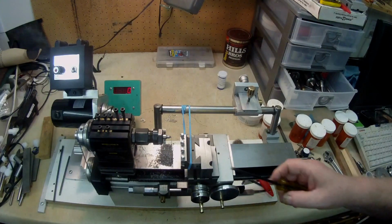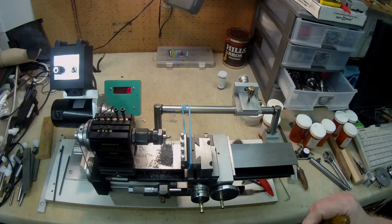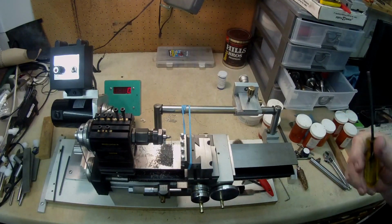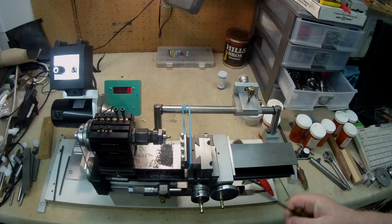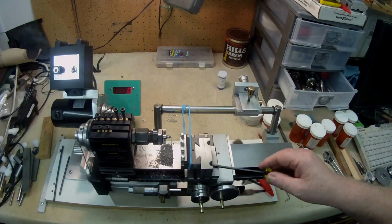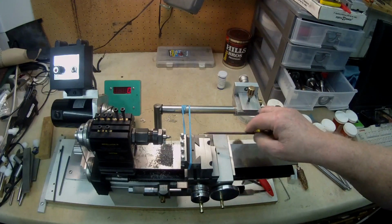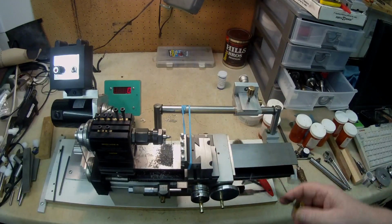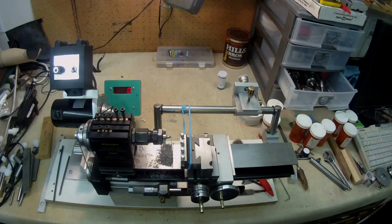A couple of mistakes I made on this, and I put it down to working things out in my mind instead of double checking with drawings. I would have noticed it, I'm pretty sure, if I'd done a drawing. When I put the two step pins underneath this base that aligns the tool in the T-slots, it means that I don't have to square anything up. That automatically squares things up, and then I just nip the T-nuts up.